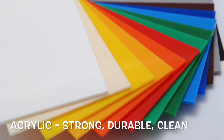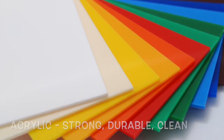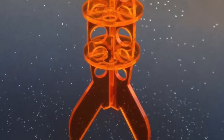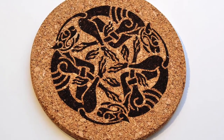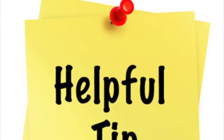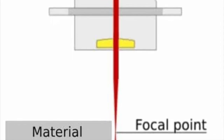The second most common material is acrylic. Please remember that we will need to see proof that your material is indeed acrylic, or we will treat it as polycarbonate and not allow it into the machine at all. This material is strong and can come in various colors or opacities to create very interesting shapes and designs. We do have for sale approximately 12-inch square or smaller pieces at various prices in both blue and clear. Other materials such as, but not limited to, glass, cork, leather, powder coated metals, laser safe rubbers, and many other different materials are all possible to either be etched or cut in our machines. A note that will help your project's success is that any material in our laser will need to be as flat as possible. Being flat means that the laser will stay in focus and cut or engrave evenly. Cups or round objects being used with the rotary tool will also need to have a straighter side rather than a round ball-like shape.